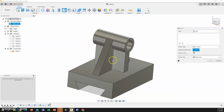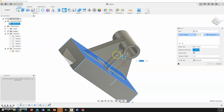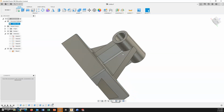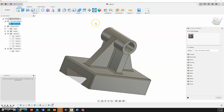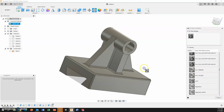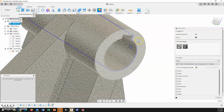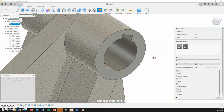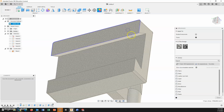Casting fillets. You have casting fillets that are a radius of 2. All my casting fillets are on. Material is malleable iron. And you have machined surfaces. The key seat is cut, is a machined feature. And you have machined surface symbols for the bottom and the dovetail cut.